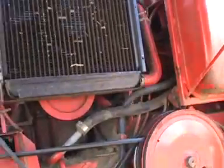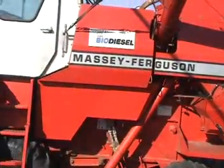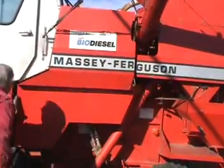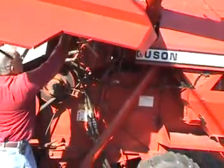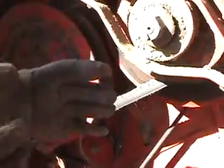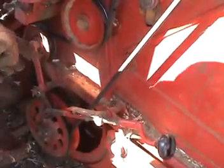And that's the engine — I'll open up the other side over there, you're about to see the engine better. That's a 70 horse Perkins, four cylinder Perkins up there. That's a pressure cylinder behind that. That's a variable speed pulley that you've got to crank up in the cab, where it can open and close both of those pulleys right there. And that's your fan that blows the air up through the sieves to blow the trash out.